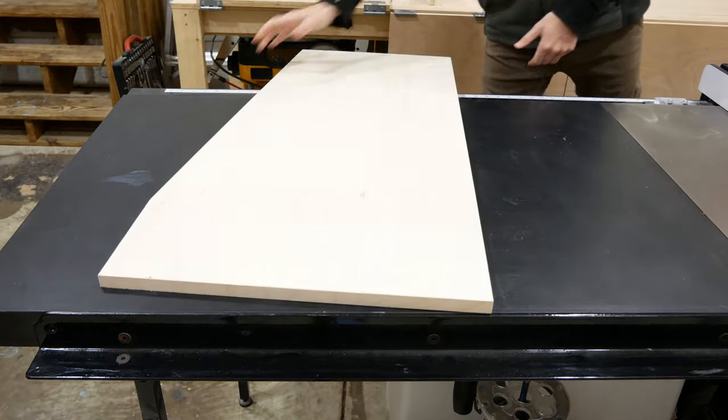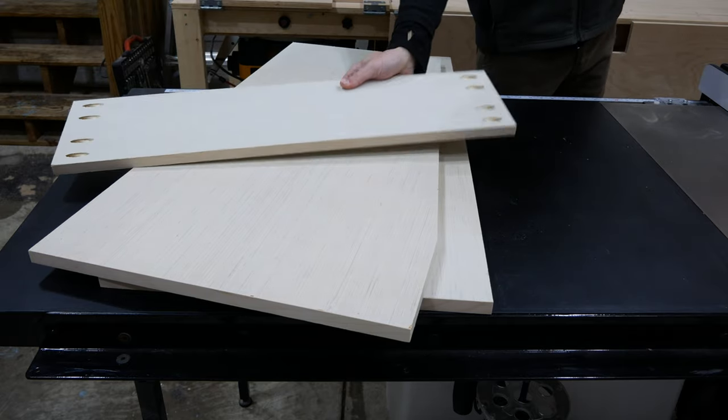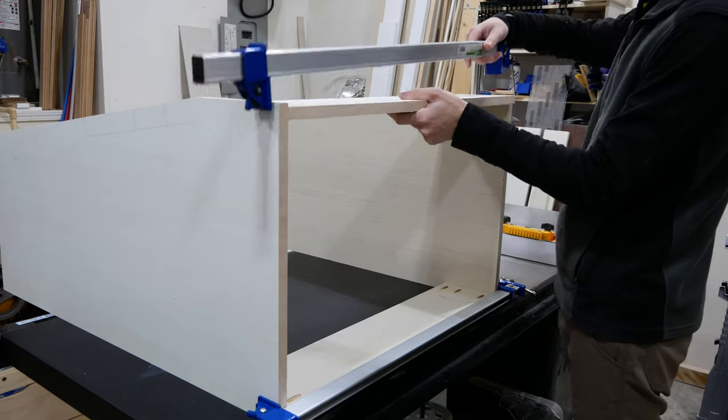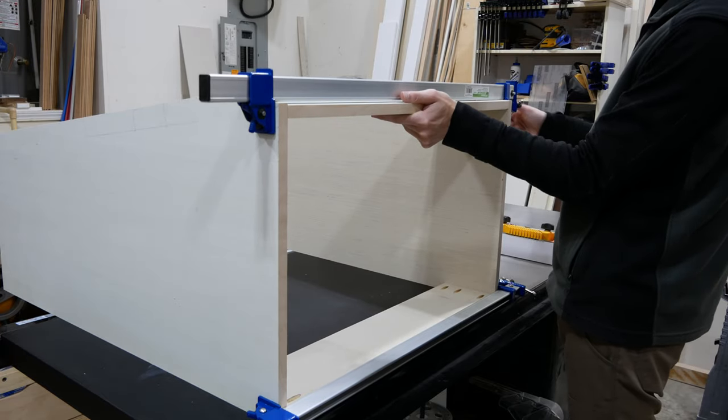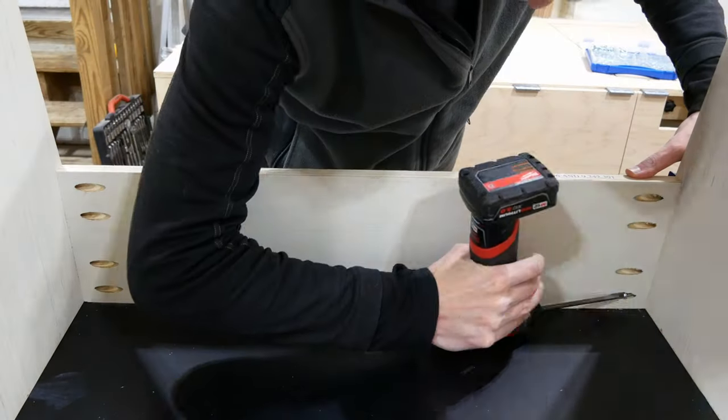Once cool I trimmed the banding at the ends and then along the long edges of the plywood, and I'll repeat this on the bottom edges of the other three pieces of the cabinet that will face down towards the stove. I've linked a guide for those not familiar with edge banding down in the video description. I clamped the range hood together using woodworking bar clamps and then screwed the front cross piece in place using pocket hole screws.